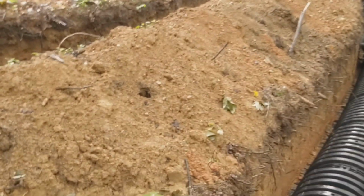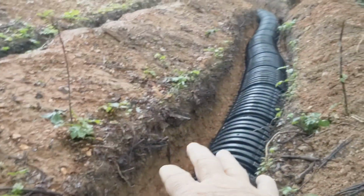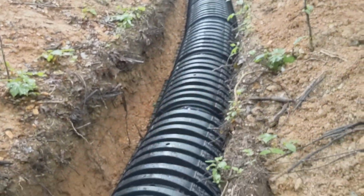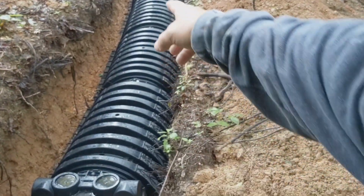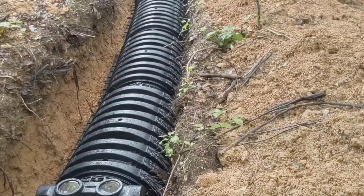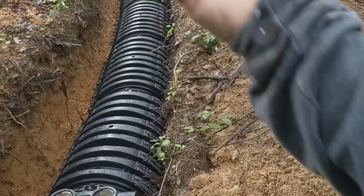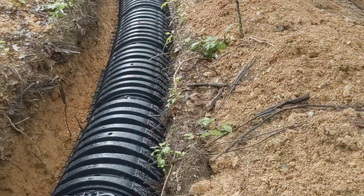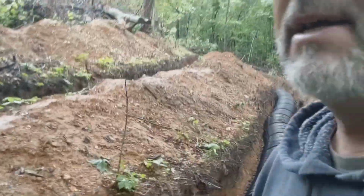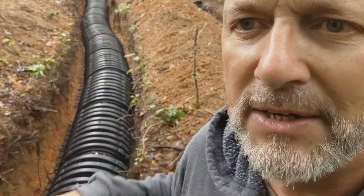And it's where the side, now it didn't happen here, but it did happen here the other day on this ditch. And it's where the side of your ditch, the rain causes it to collapse in on the chamber, or to collapse in the ditch, and then you got to hand dig it out. Now if it collapses in on the chamber, it's fine, but if it does it before you set the chamber, then you got to go down through there and hand dig all of that stuff out, and that's not fun. We've done that a time or 100.